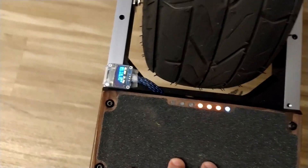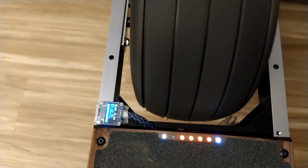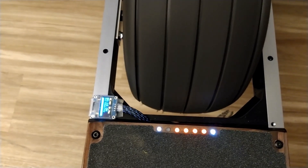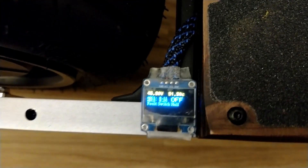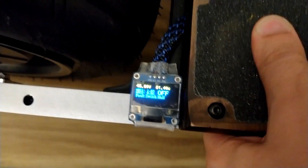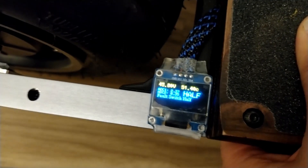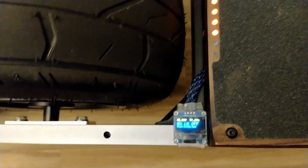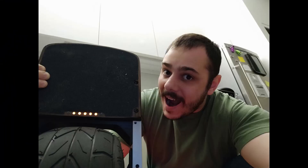Here I have my beeper set to 80% duty cycle and you can hear it going off. This one is not very loud but you can add whatever beeper you like. Here, as you can barely make out, is the display. It shows voltage, MOSFET temperature, ADC values, and as I push it you can see the switch state toggling. It also shows the most recent fault and some duty cycle info.